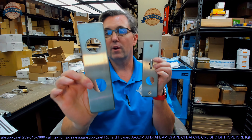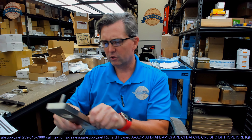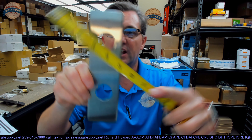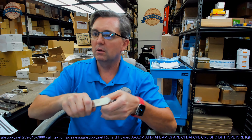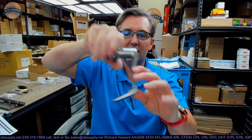Let's take a look at the rest of the material. This is going to be an escutcheon trim lock. Here's your exterior, here's your interior, where your levers are going to go, and then of course your cylinder. Let's take some basic dimensional properties. Overall height about 8 inches, overall width about 2 and 3/16 inches. Overall projection of the escutcheon is about 9/16 inches. Included in the part number is this typical, most common of all handicap compliant levers.